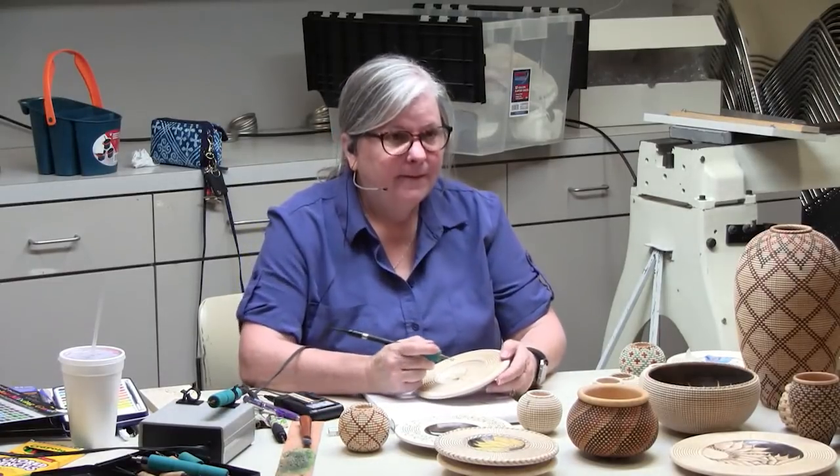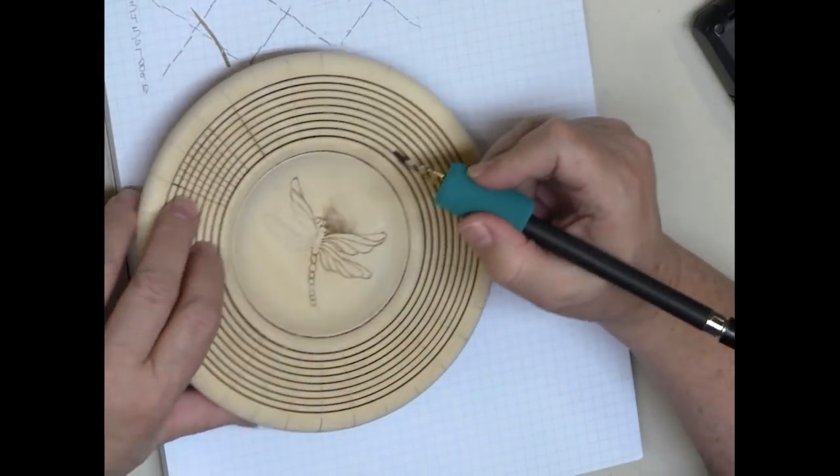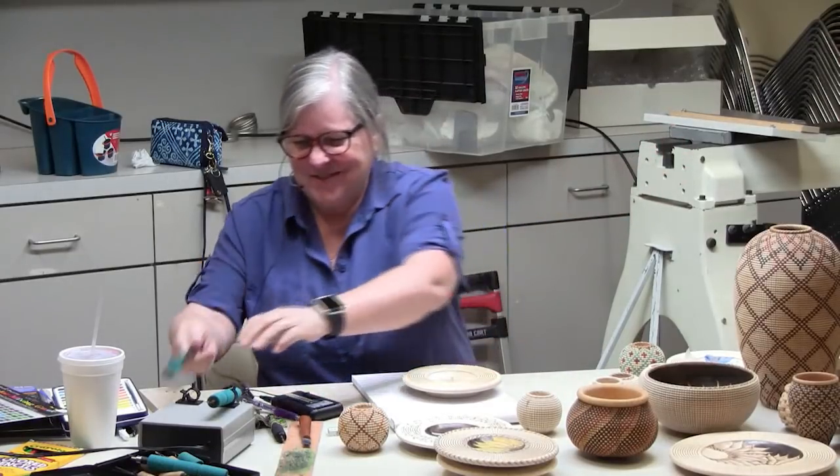You can add alcohol to the ink to dilute it — actually water works too, but I liked alcohol because it dries a lot quicker. You can mix up a big batch for a consistent color. But with ink, if you make a mistake it soaks in and is really hard to get off — you pretty much have to carve away a bead to get rid of the color. So I decided to try watercolors because watercolors pretty much stay wherever you put them and don't wick unless the wood is wet.